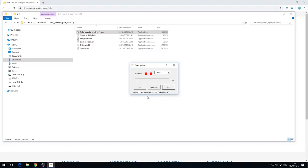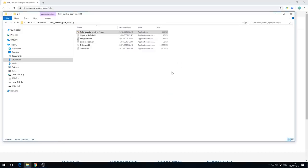Make sure the receiver is not powered up when you first open the tool and select the file. Then press download and you'll get the flashing lights as it writes the firmware. Make sure your LiPo is fully charged — it took about 10 minutes. Press end, unplug the battery, unplug the USB, and let's go see what this ACCESS protocol is capable of.